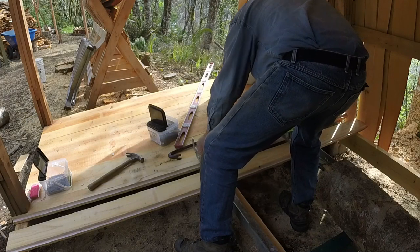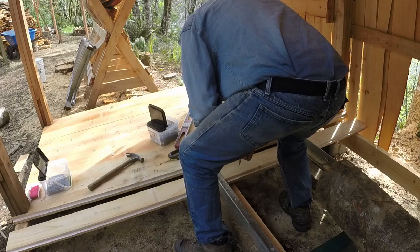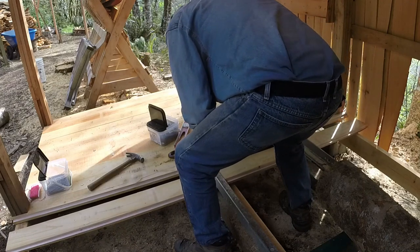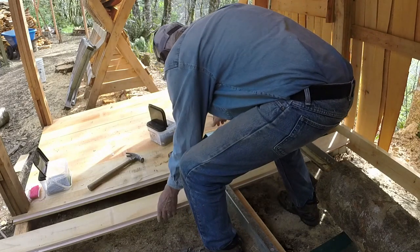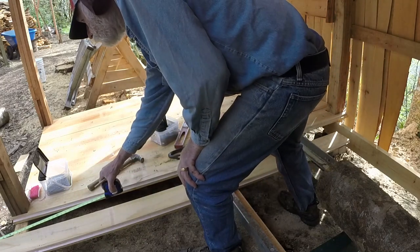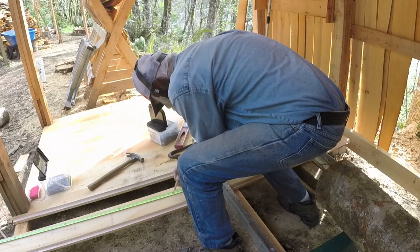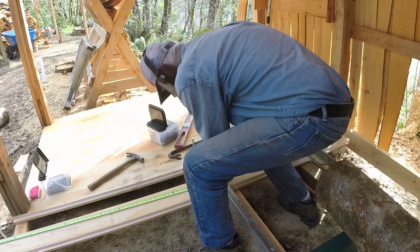I decided to leave the mill track on the beams for two reasons. One, it would be an awful lot of work to remove it and replace it. And two, I didn't want it sitting on green wood that would shrink and swell and curl at uneven rates, which would require me to constantly realign the tracks. It was a little bit tedious making cutouts in some of the boards to go around the feet, but all in all, it was a better alternative.